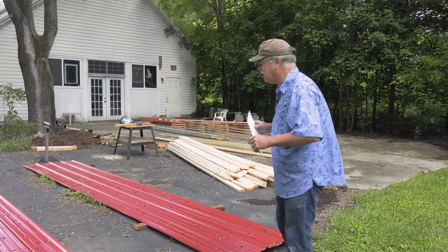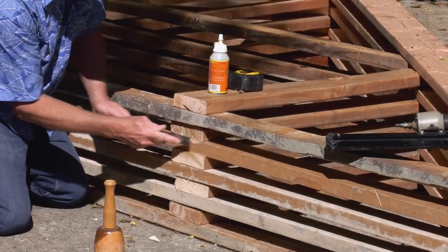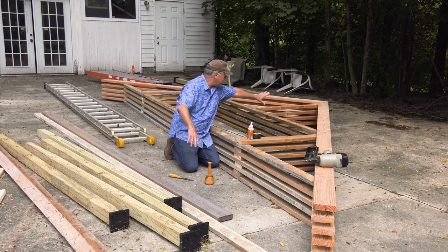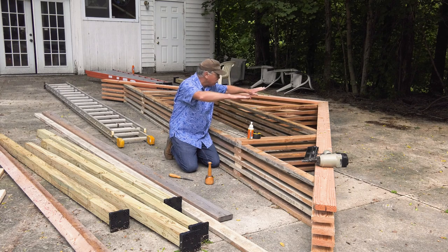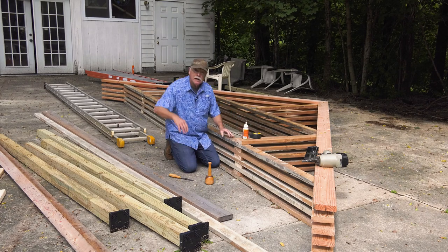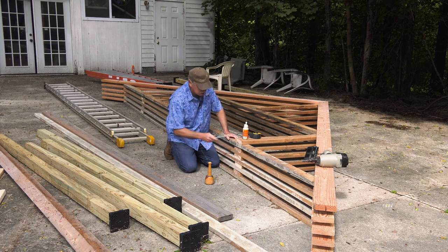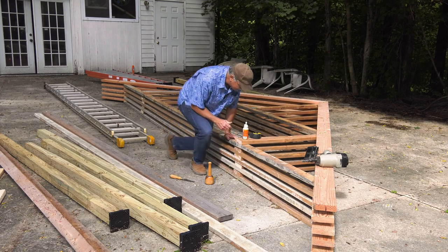So with that being said, I want to show you one thing on making your own trusses. Come with me. I'm saving a fortune by building out the trusses. I just had the top caps right there, the stop there. I put 14-foot rafters essentially on top of those caps, and I used polyurethane glue. Now, a day later, you'll have squeeze out, and when you do, just use a sharp chisel and chisel it away. You don't want to put that up under a rafter, that'd be bad.